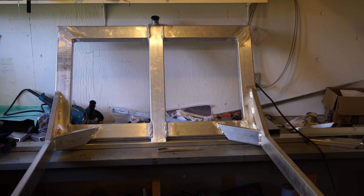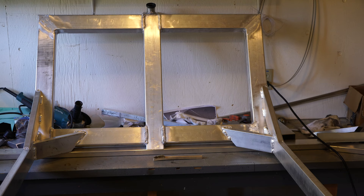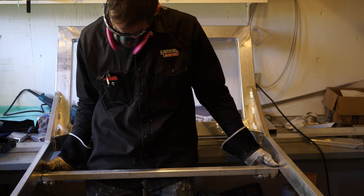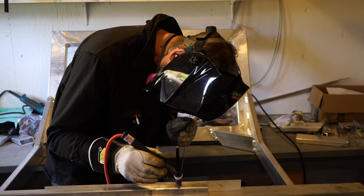Here's a shot of the frame and the inner welds — you can see they're really beefy. The outside welds I did grind off because I want to create a flat face for the aluminum composite panel. I know that does weaken the frame, and I tried my best to leave as many welds on as possible, but based on some earlier tests with a sledgehammer smashing away at some of these joints, I feel like it's going to be more than strong enough. We will see.